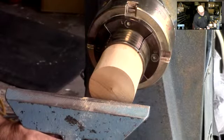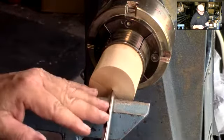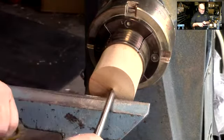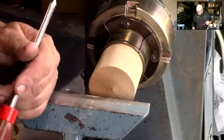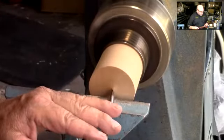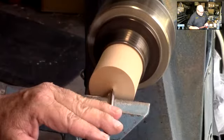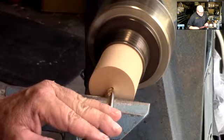Now my rest is a little bit low right there, so let's raise my rest up. That's going to make me a good entry right there. If I hold the tool level, I'm just above the tool rest. As I come in and enter on that second line that I drew, just behind center between four and five o'clock with the flute matching that radius, the bevel pushes my gouge into center.